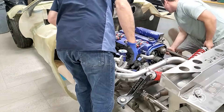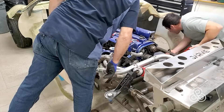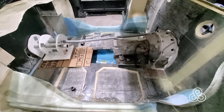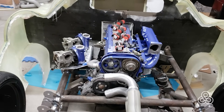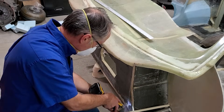The solution was to go with a less expensive mass-produced transmission and use it in a rather unconventional way. I've turned the engine around backwards, placed the transmission forward between the seats, and made the car all-wheel drive. This may sound like it would be more expensive, but when the transmission only costs $350, the budget is still open for all kinds of auxiliary components to connect the wheels to the power.